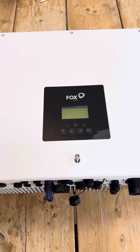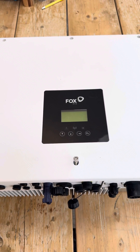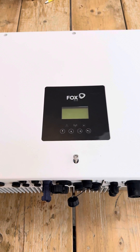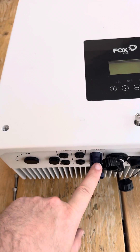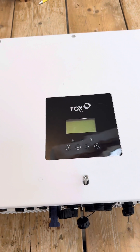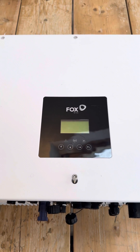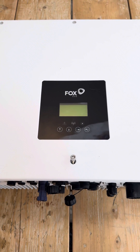On this week's Fox Friday, I thought I'd walk you through the internals of a Fox ESS inverter. This is the AC charging equivalent of a H1 — this is an AC1 5.0, exactly the same as a H1 5kW model, with the difference being that the PV inputs are all blanked off, there's no PV isolator. You just have battery terminals and an AC terminal, and it is just a battery system that covers your house load. This would be an ideal system for someone who already has existing solar and is looking to add an AC coupled system, or someone looking to expand what they already have.